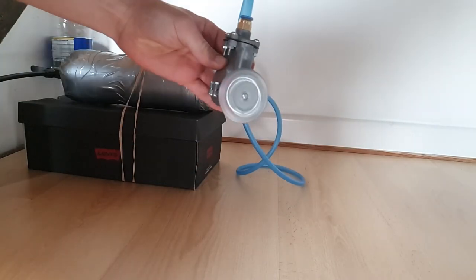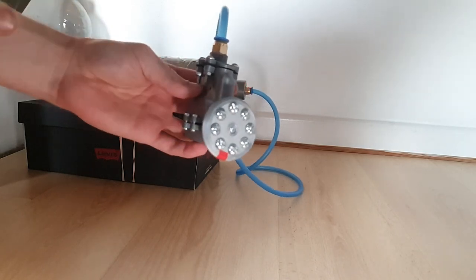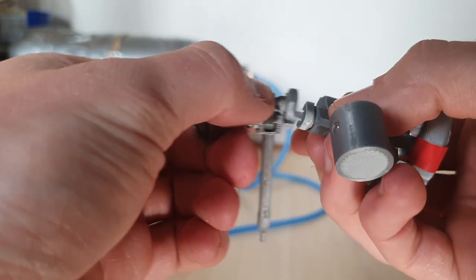And then I broke it again. So the rear crank snapped in two places. I think the shaft needs to be thicker and the actual part which connects to the front push rod needs to be thicker. So I think I'm going to have to call it quits with this engine. I'm quite limited with what I can change due to space restrictions, so I'm not sure how I can improve this engine anymore.